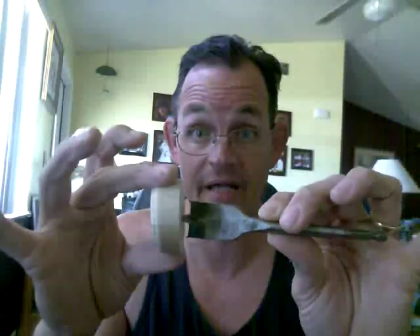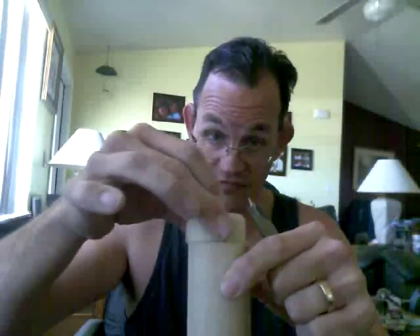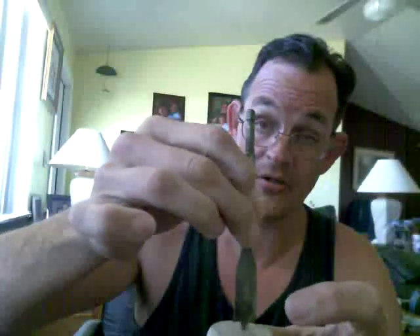From the bottom of the lid - not the top - because this cap is going to sit inside. You need to get that one-inch diameter, and there's your pilot hole. Take your one-inch drill bit and the point goes right in the pilot hole - you don't have to worry about lining it up, that's what the hole is for. Go probably about halfway in; that's going to leave enough room for your cap to sit in there, and the negative ring that mounts on top will actually recess into the lid. Then from the top, your 5/8ths drill bit - oddly enough the top of the button is the perfect size for a 5/8ths - go straight down through the pilot hole. It creates a tapered effect to the hole.